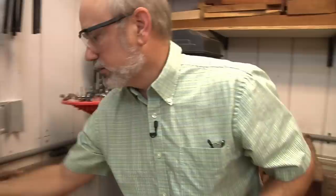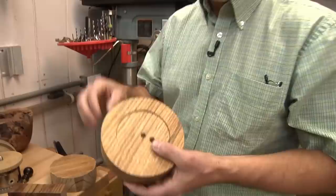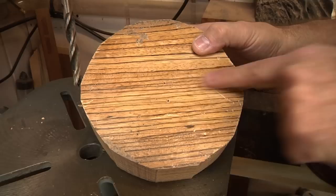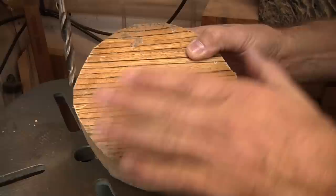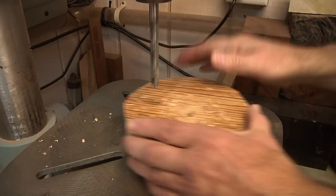On the piece I have over here, we've just drilled the hole that goes here to hold this side. We're going to drill this hole next. You can see I made a lip here so it goes down about an eighth of an inch. I need to adjust the drill press to go just a little bit deeper. One design note: I took my dot straight out from here and I have the grain running this way. Don't just put it willy-nilly — this will make it very dramatic if you select the grain running perpendicular or parallel to wherever you're going to set things up. Really pretty that way.